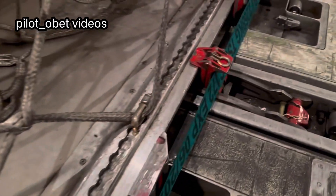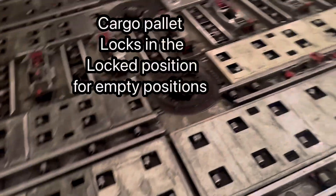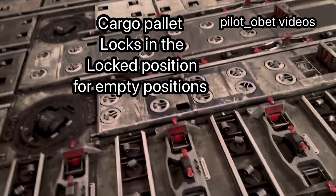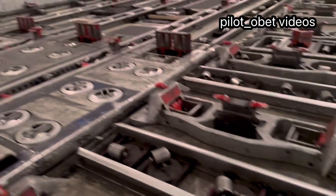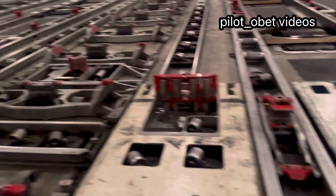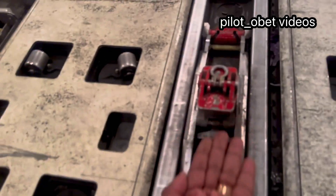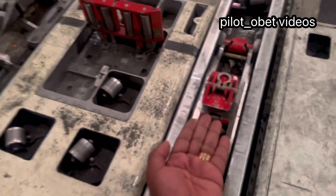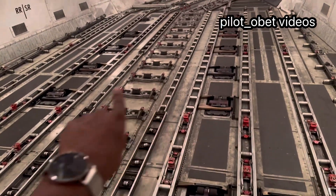All the cargo positions — these are locked as well and completely immovable. These cargo positions lock the cargo in place, but for the empty positions, all the locks must be up as well. This is an empty position, for example, and all the locks are still up as if a cargo pallet was there. If the pallet moves from the front, it has to hit that lock; if that fails, it hits the next one, and the next ones after that. So all along there, in the empty positions, all the locks must be up.